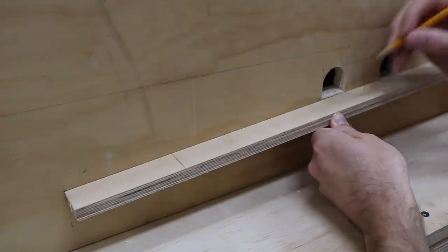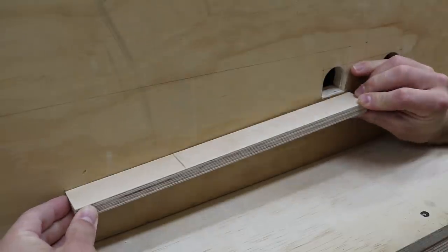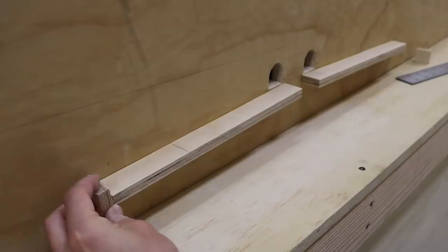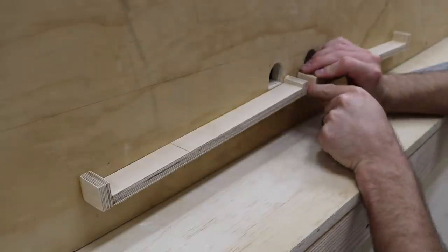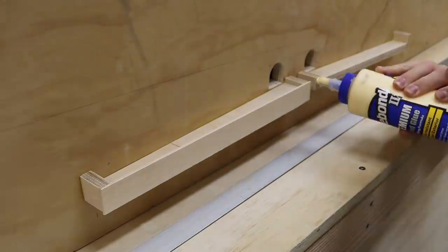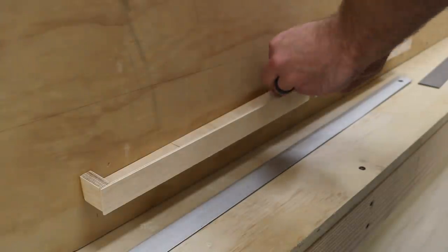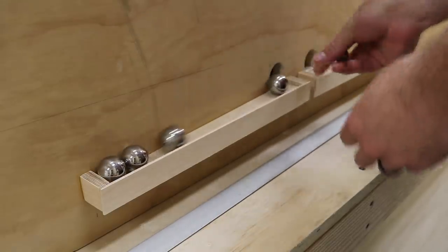The scoring ramps were really easy to put together. I already marked out how long to make them based on the length needed for 10 pinballs. I used 1/2-inch plywood for the track and end barriers. The barrier at the bottom of the ramp is a bit taller because it's the stopper. At the top of the ramp, it's really short because it can be. For the face, I used thin 1/8-inch plywood to keep the profile smaller. I'll go through and clean it up later, but for now, the scoring ramps were looking and working great.